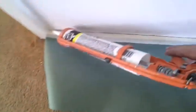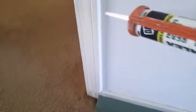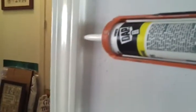I think it's just better ergonomically because then I can hold this thing like this. I don't get stuck having to hold it way down there. And when I'm caulking a door jamb, I can just keep this thing vertical all the way down to here. I can go down a lot farther. And if I've got it cut at a big angle, then I need to hold my caulking gun at that exact same angle. So when you're coming down a door jamb and you get to about right there, it's not very comfortable. You can reach down here and then try to go up, but if you've got it cut where you have to hold it almost straight, you can come down to more like right here. It's just so much better, I think.